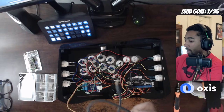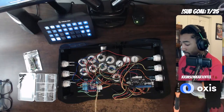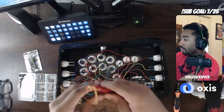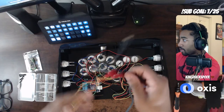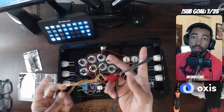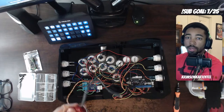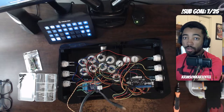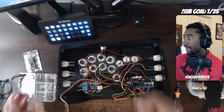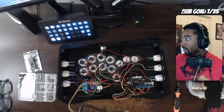Because it is on this very tangled up cable that we get our power supply for the additional boards. So traditionally, when you're adding an add-on to the main PCB of your arcade stick, that additional board needs some amount of power supply. And usually the way the base PCB gets it is through the main USB cable that gets plugged into your PC or your console.